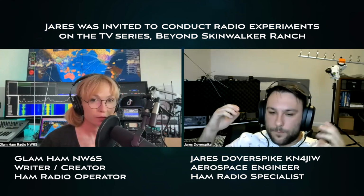So you're going to be dealing a lot with very directional antennas. The full length of this antenna that I have back behind me, this is about half of it. It's a 6 foot, about 2 meter length antenna that I use for 23 centimeter EME. And then on top of that, I have my ICOM IC-9700, which I use for that, which is only 5 watts. But if you're talking with a station that has a large enough antenna, that 5 watts can be enough to get to them.